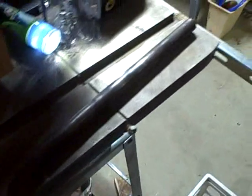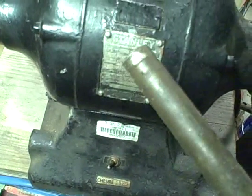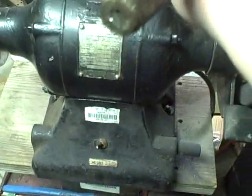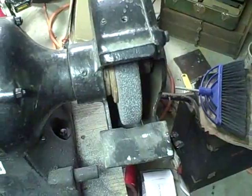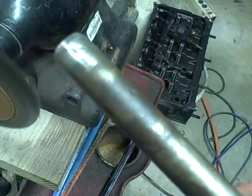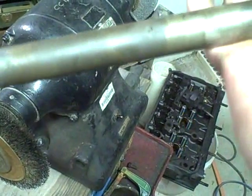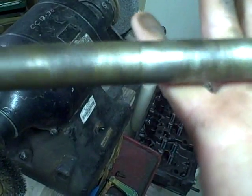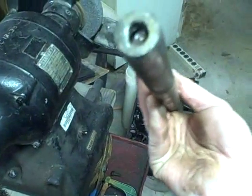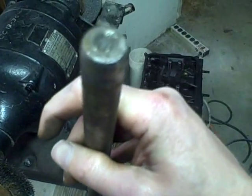Let's see if we can clean up the ends and slide one of the control levers on it to see if it binds. By 'clean up the ends' I mean there's some damage on the ends where I was being very abusive trying to get the rod out when it was bent and stuck in there. The bench grinder will do that. I just finished grinding it on this side and cleaned it up with the wire wheel. You can see where it's kind of galled up, but it's a lot better. I put a bevel or chamfer on the edge there, which is going to help in getting it started. I'll do a quick check, and if that checks out I'll clean up the rod — there's a lot of old grease on there and what looks like some surface rust.